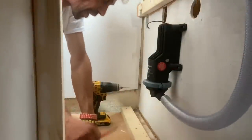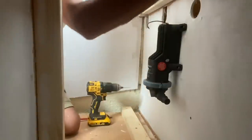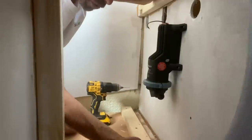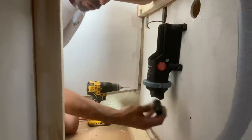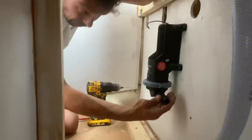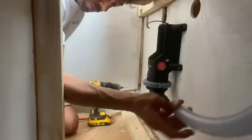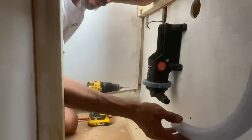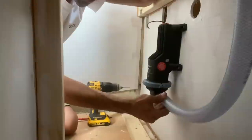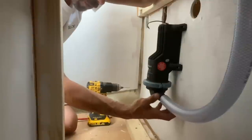Right, so now this hose here can be connected. Now there's a valve on the Gulper, and the simpler thing would be to put that into the hose straight away, but then you've got to twist it on there, and this hose can't be twisted. So I'm going to put the valve in place first, and then I'm going to dip this in a bit of hot water for a little while. I'll make myself a cup of tea whilst I'm doing it. That'll make it a bit more malleable, and it'll be able to slip onto there nice and easily. I don't really want to push it on too much against the Gulper. And then I can put a Jubilee clip on there nicely.